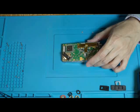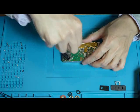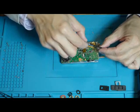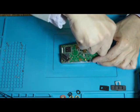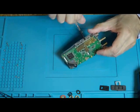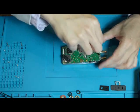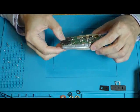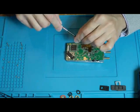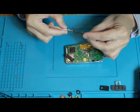He's going to do the countersunk screws first. There's three places: one right there at the circular speaker silkscreen on the board, one at the top, and one on the push-to-talk side. These countersunk screws kind of align the printed circuit board correctly — it's a good fit. You really don't need to align it, but it's the safe way to do it. Next he'll install all nine of the standard screws that hold the PC board to the metal plate. The bottom two holes do not get a screw — those are for the through-hole screws that mount to the plastic case.